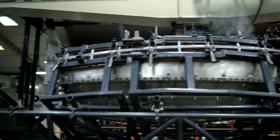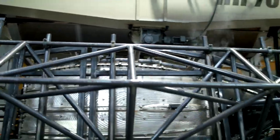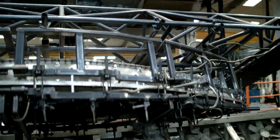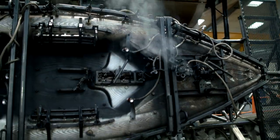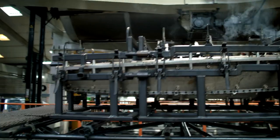All of the cooking within the oven is now complete and the tool is brought out to carry out a cooling phase. This cooling period is a very important part of the rotational moulding process, as it is during this time that the chemical composition of the plastic crystallises and gives the product its strength when finished.